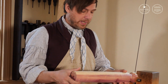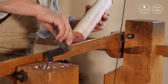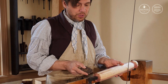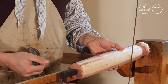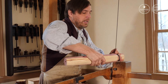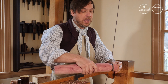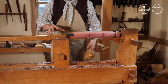I'm going to put the piece of wood between these two iron centers where it will rotate, but first I need to rub beeswax on those centers. As the wood comes in contact with the iron it creates friction, which creates heat — a transference of energy that turns into resistance and makes the wood harder to turn. The beeswax will melt with that heat and make it spin more freely. I'm going to wrap this rope around the groove I've made; each wrap gives me a full revolution as it rotates. More wraps create more friction, so two wraps is my ideal mechanical advantage. Then I drive that wedge in and the friction holds everything together.